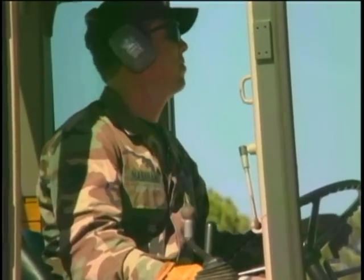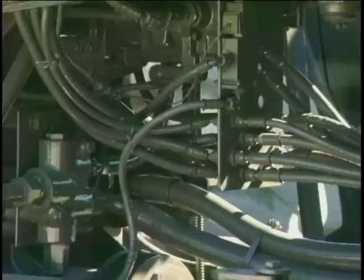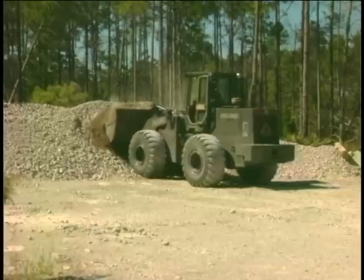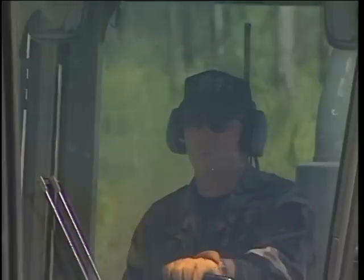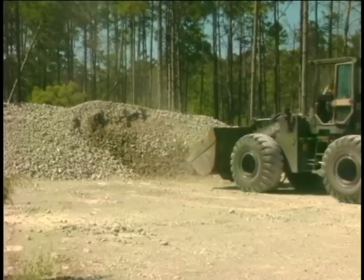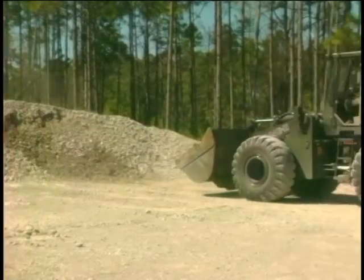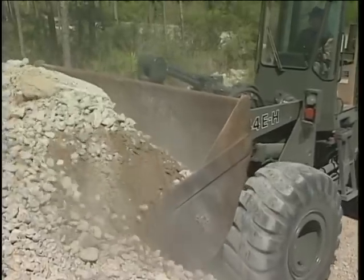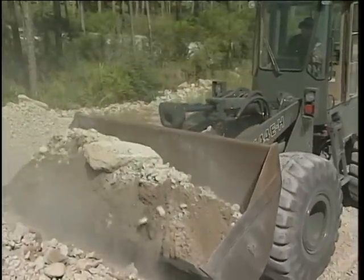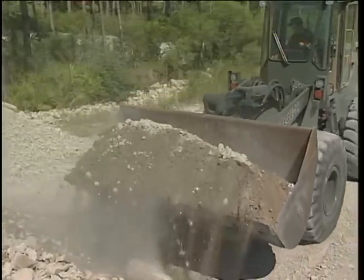What a lot of novice operators forget to do is let the RPMs drop back down before they disengage the clutch cutout feature. This high RPM transmission engagement creates severe jerking movement, which is hard on equipment and the operator. Each loading application is different, but for the most part, leave the clutch cutout lever in the drive position. The transmission will stay engaged when the brake pedal is applied, and you should have sufficient power to drive the loader's hydraulics.